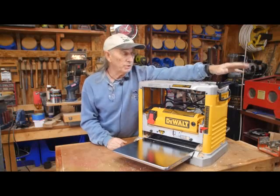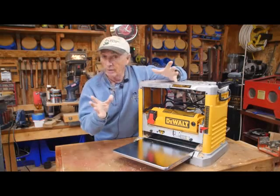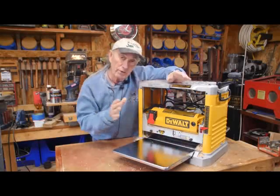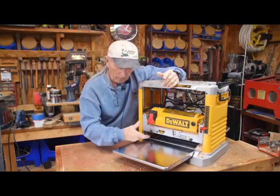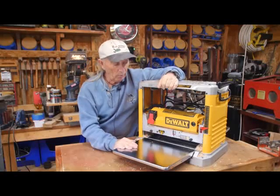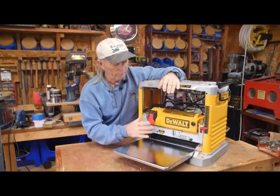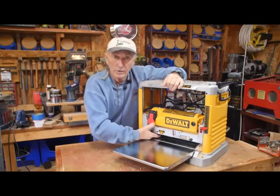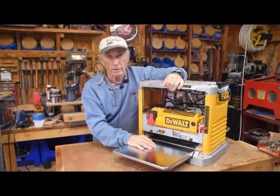This one here is really your adjustment for driving this thing all the way up and all the way down. It's a little over 12 inches — you can get up to 12 and a half inches and run it through. But you're going to run into problems. There are guides up in here, and if it gets caught in those guides a little bit, this will jam. It did jam on me once, and I realized the mistake — everything had to be absolutely dead in line to run the 12 and a half inch board through or it could get hung up. Even local contractors were taking some of these back to the store because of the jamming situation. So just be aware. Make sure all your boards are nicely lined up and won't run into these little guides on the side, because you want that board to just walk through very nicely and do a fabulous finish.